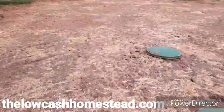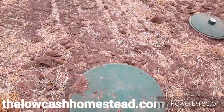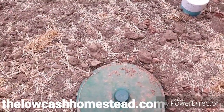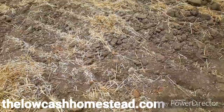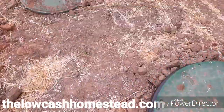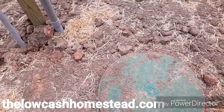Let's take a look at how this works. We have our clean-out up there by the house, and then this is our main tank. That sound you hear — that's a venturi air system, sucking air through a venturi and aerating the tank. We have a clean-out there, some valve assemblies here, and then this is the dosing tank. I believe both tanks are a thousand gallons, and they say this system will treat 750 gallons per day.